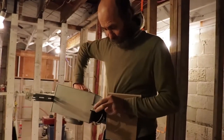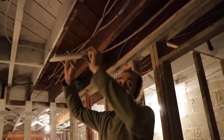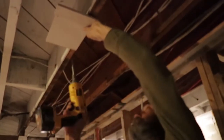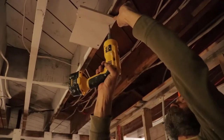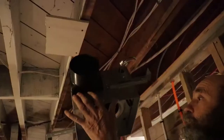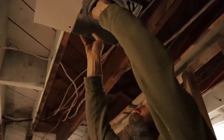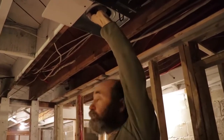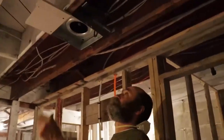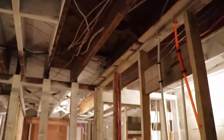I'm gonna bang this in with the hammer, but this metal is soft so it did not go into the wood, so I'm gonna use screws instead. One thing you guys can do: if you're gonna use half-inch drywall to get the right measurement, you just put it right there and pop a few screws in. If you're gonna use five-eighths or a double layer, you just have to get that measurement from there. When you're doing the fan, you have to set it up to be flat with the finishing drywall. I'm gonna set it just one-eighth inch higher than the drywall and use self-drill screws to go through the metal. Now instead of banging with the hammer, I'm just gonna put a few screws on the bracket.